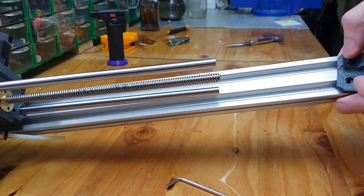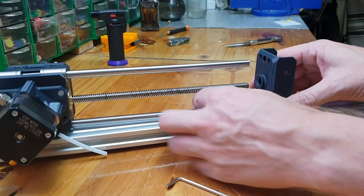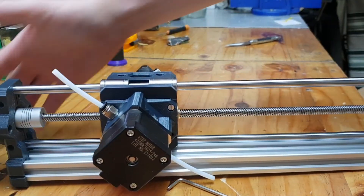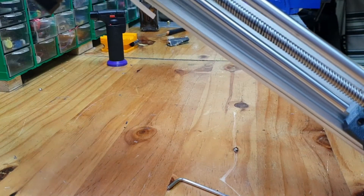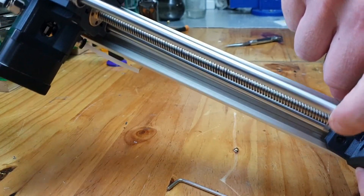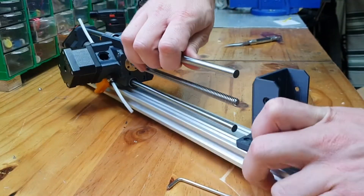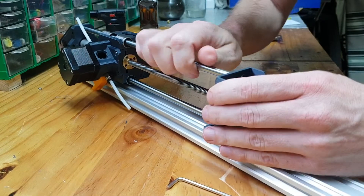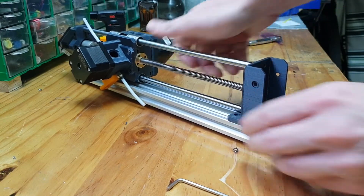I just put in a little T-nut so it cannot go anywhere. This part is also a little bit tricky because these holes are exactly eight millimeters and the plastic kind of pushes everything skew. You can see that this bar has to sit around there — it's not in line with the extrusion — but this bottom part will ensure that it aligns perfectly. This is a bit tricky but if you bore the holes out a little bit then that should be fine.